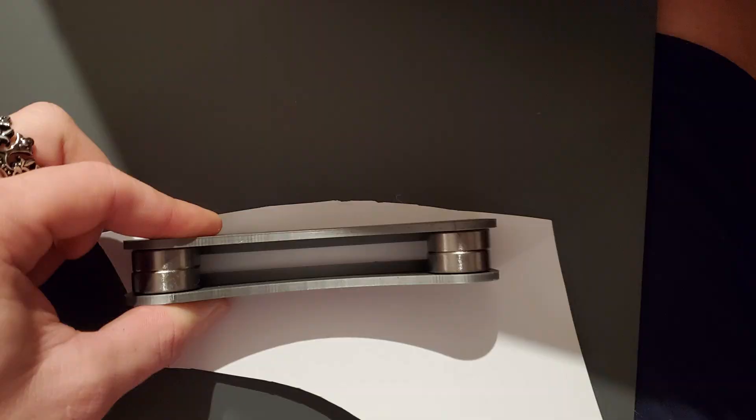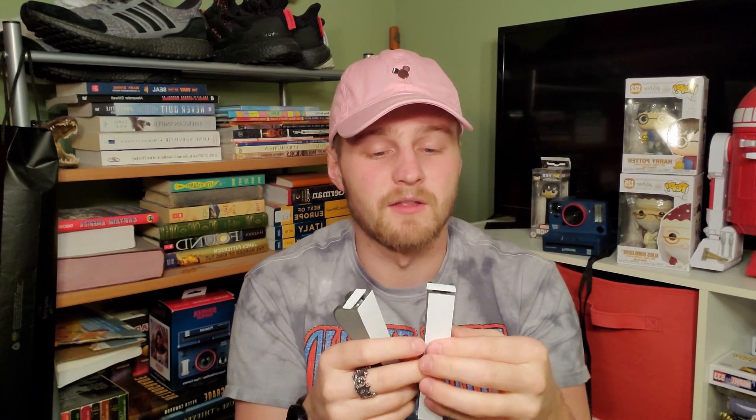These little bearings are called 608 bearings — you buy them on Amazon, I'll put the link in the description. Normally you'd only put one in each side, but I had to use two per side, so four total. Thank goodness I ordered the 10-pack because I almost ordered the 6-pack, which was actually more expensive. So I modified these pieces: I took some polystyrene — that white plastic stuff — fitted the two bearing holders together on each side, traced them onto the polystyrene, cut it out, and super glued it to the bottom. I put backing on both sides just to make sure they stay together solidly.